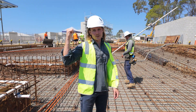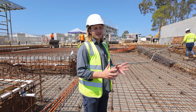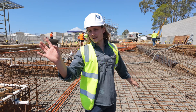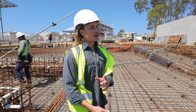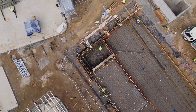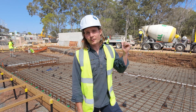We're starting with the spa — all the boys are in there now shaping it and spraying it. It's always good to get the spa done first because it's technically a separate entity to the pool. Then we move on to the rest of the pool and start spraying — do all the sides, and the floor will come last. Normally the logistical challenge with spas is they're really small. But this being such a big pool, the spa is almost the size of a pool itself, so we can sit right here and pump next to it.